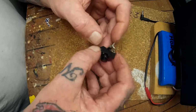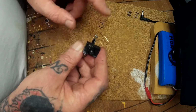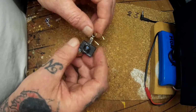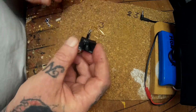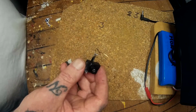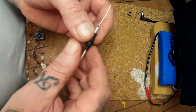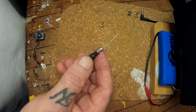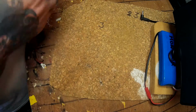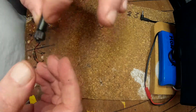on the back. So what I'm going to show you here today is I'm going to be changing this out for a dipole. I'll show you my mod, and it's worked, and you will see the result at the end of the video. To save you making up any sort of antenna like this, if you have any of them dipoles lying around the house, which they basically come with all ready-to-fly quads, and probably other quads as well nowadays.